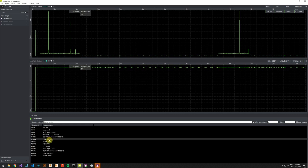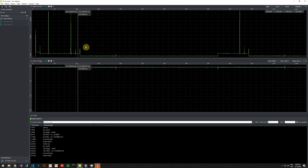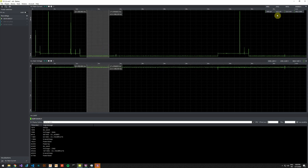Then the device goes into something I've called grace sleep, and this is an intermediary phase before it completely powers down. And this is something I implemented just in case someone would open and close the lid of the mailbox several times, or there was some kind of vibration or something like that. So in the grace period, that would account for this period, the device is sleeping for 8 seconds. So we can see what kind of current consumption is going on in this period.